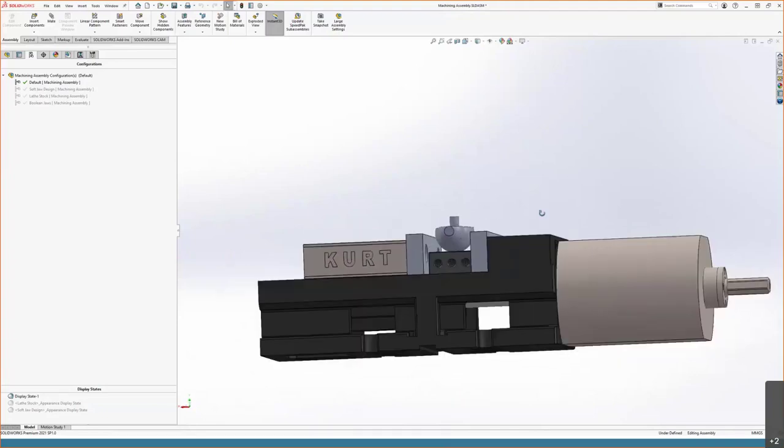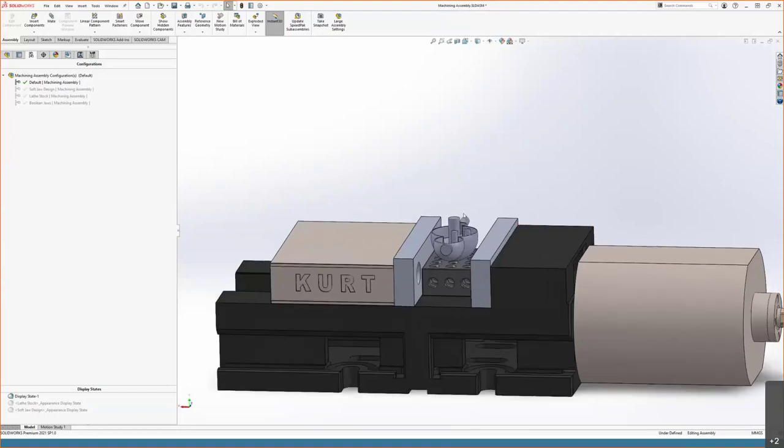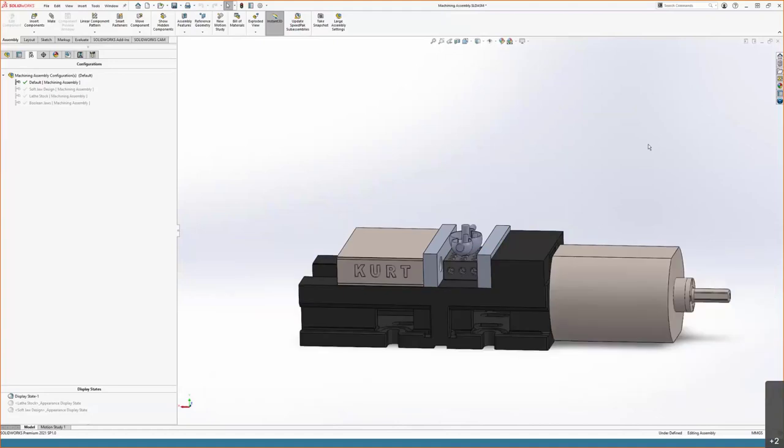One of the other reasons why I have everything set up this way is because I have a SOLIDWORKS CAM Pro license. That means that I can get everything set up in an assembly and actually generate my G-code from here. And on a tricky part like the turbo encabulator, there are not a lot of great places to zero things off, especially for Z. So what that lets me do is use a fixed face on the top of the vise, or use the top of the 1-2-3 block as my Z height for getting things all set up.